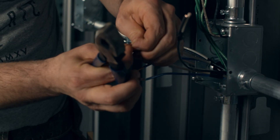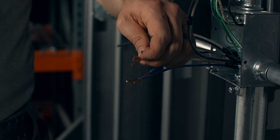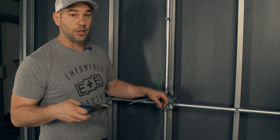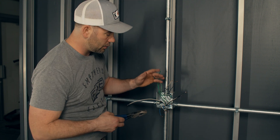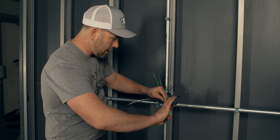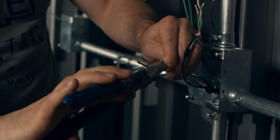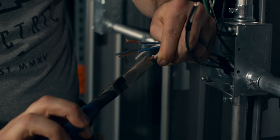You know how on solid we would twist them together? When you twist stranded, it can get really weird. You've got to be really, really careful — see how it just flares out like that? So I'm actually not grabbing tight with these linemen's. I'm very slowly twisting and pinching at the same time, twisting and pinching, and I'm kind of sliding down too. And see, whenever you cut it, sometimes at the end of your linemen's it'll leave this little tail. You've got to be really careful about that because it'll make a bad connection in your wire nut.